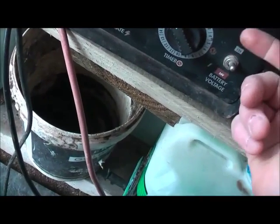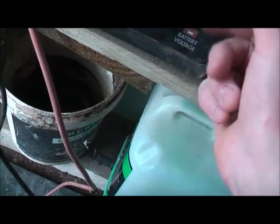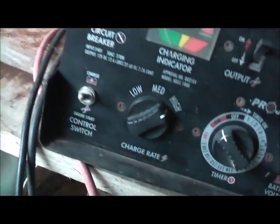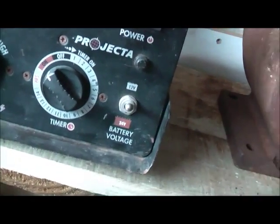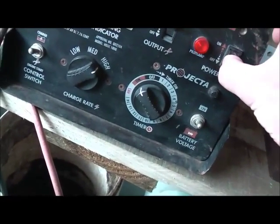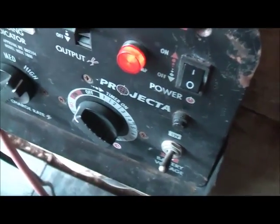This is dirt. Dirt in that breaker. And you hear me? We've got a dirty breaker. Yeah, it's fixed. Alright, it's that bloody stupid breaker. Bad connection in that breaker. Well, I could bypass, but if something bad happens, there's nothing to protect the primary from overloading.